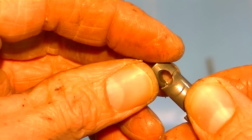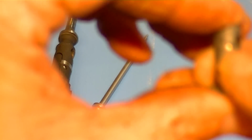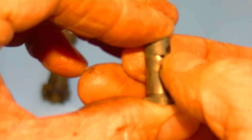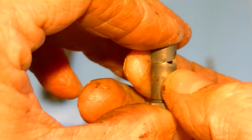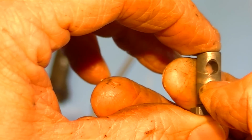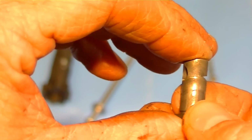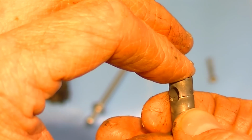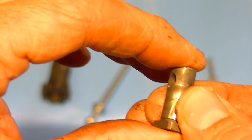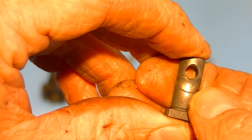And everything was obviously properly lubed, taken care of. You can see as evidence with this, see that chip missing? That tells me that this thing was hardened too hard. Whenever this was originally hardened after machining, they either got it too hot initially, or, more likely, whenever they drew the temper in it, they didn't get it hot enough.